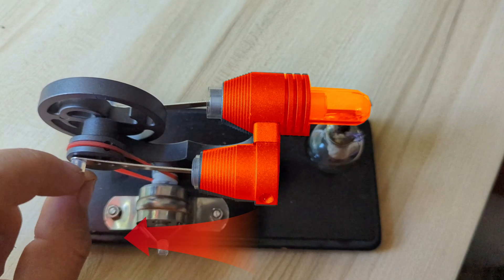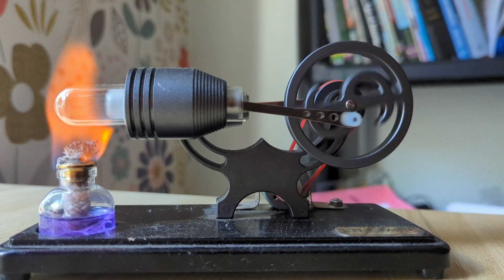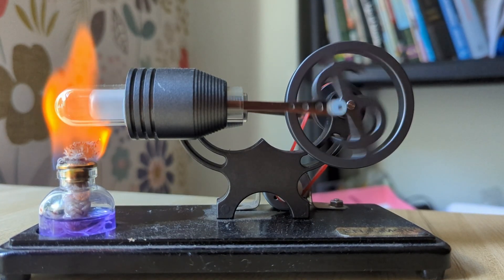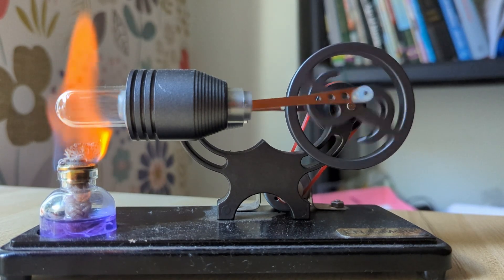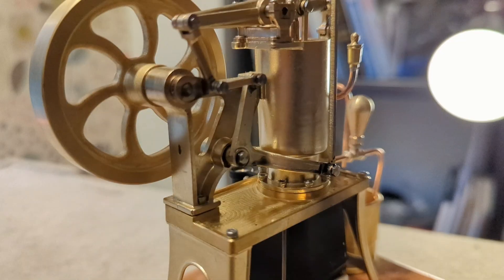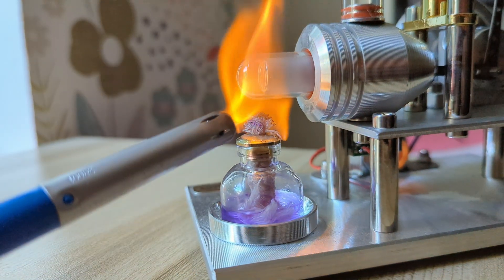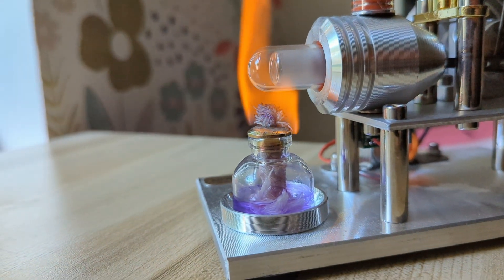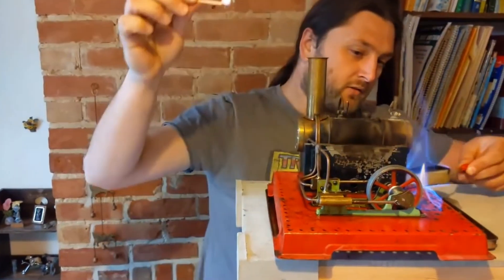This is a really cool feature because the general problem with a traditional Stirling hot air engine is that the whole thing gets too hot — it relies on hot air expanding and then cool air contracting. On a simple Stirling engine, eventually it just gets too hot and stops running because there's no great differential. Because this has a water jacket, it will keep cool. I'm told reliably it will run for a good 15 minutes until it runs out of gas — yes, this runs on a little gas tank, not methylated spirits.